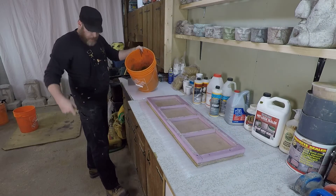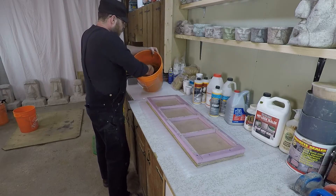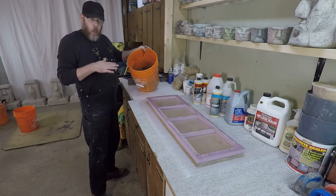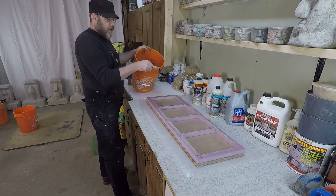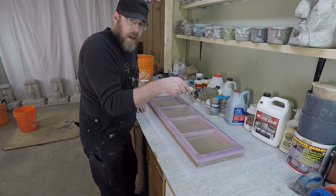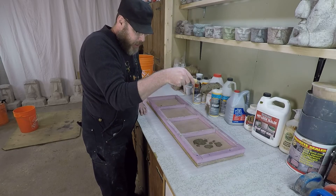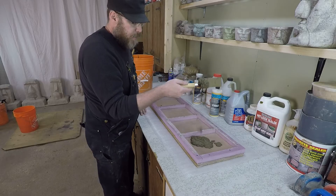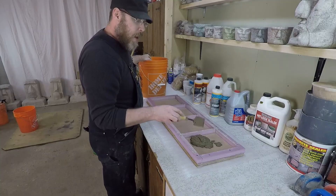I actually think this is going to make a pretty good example. I wasn't really being that careful with my measurements just throwing them in there, and what I've ended up with is what I would consider to be basically the wettest mix I would consider acceptable. As you can see when I pick it up on the trowel — it doesn't self-level, it's not a liquid. Even if I shake it a little bit, I'm starting to lose some of that height. If I turn the trowel sideways, it's kind of sticky but it should come off cleanly. That's what I'd call a pretty decent mortar mix, but a little bit on the wet side.